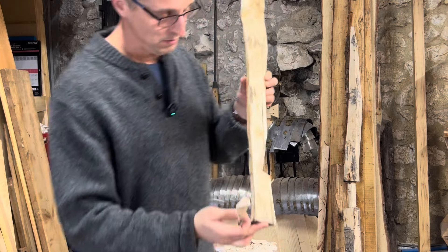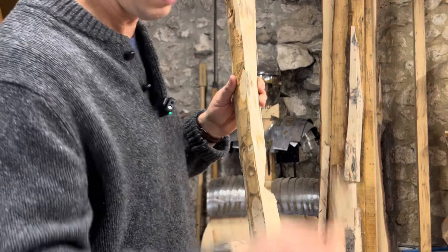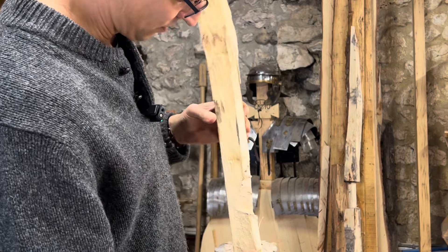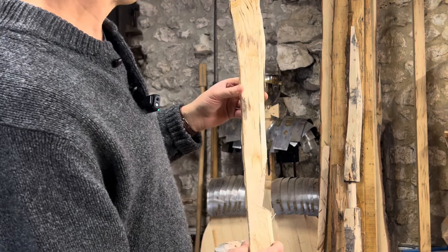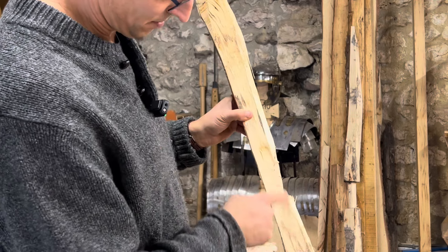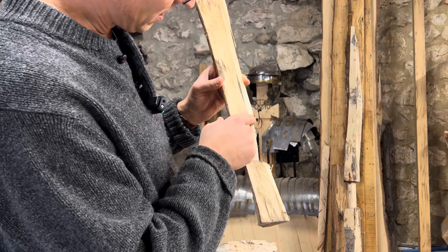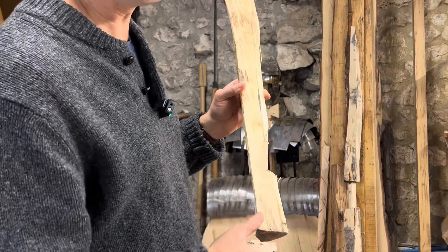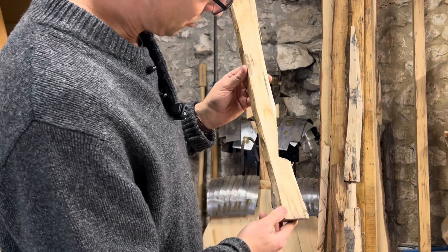We can see that on this particular piece we've been successful — I've been able to cut out a clean notch. That worked well. On the previous piece of wood I started on a knot, which didn't help. On this one it's a fairly straight grain with no nasty surprises. This end might be a different story because it's a bit knotty. The notch position is about 10 centimeters from the end of the stake, and the opening — what I'd call a bird's mouth — is also about 10 centimeters. That's how it looked in the photographs and measurements provided.